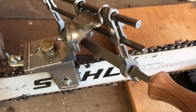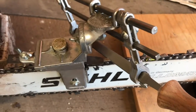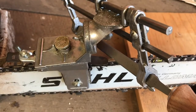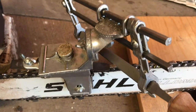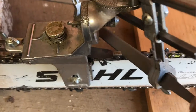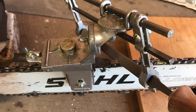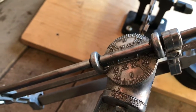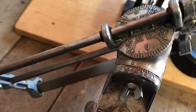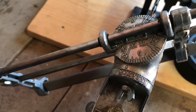I'm going to assume, if you're watching this video, that you're already pretty familiar with how the Granberg style bar mount filing guides work as far as the different angles. If not, I do have another video in my channel and playlist that explains the modern G106B filing guide, which as far as the angles go is very similar to this. The main thing is going to be the angle that goes across the cutter tooth. I set it at 30 to 35 degrees — pretty standard, the same that I would do for a round file, around 30 degrees.